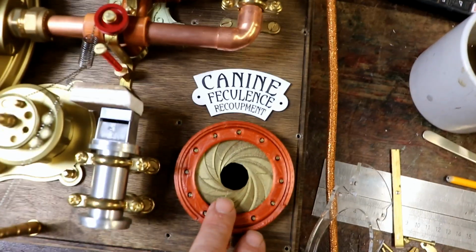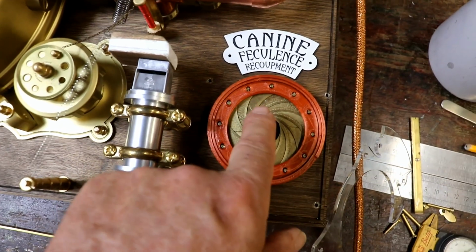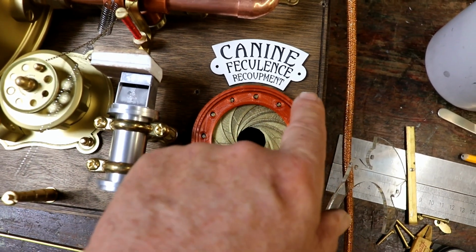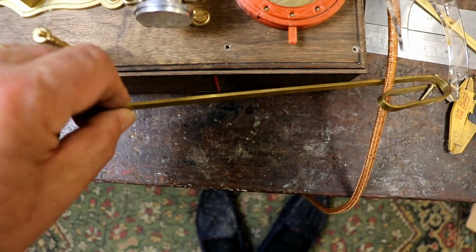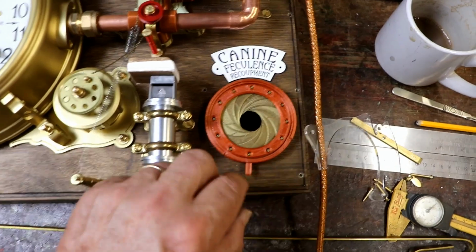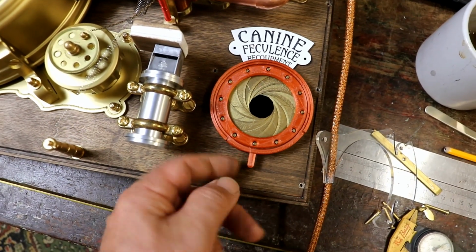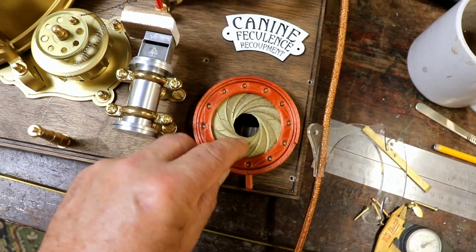So my latest thought is to make up some little brass brackets. I've got these 4 screw holes anyway that are supporting this. I can't use that one because that's where the knob goes, but I can make up 4 little brass brackets to go under the screws and sort of Z shape to just go over the edge of this, made of some nice brass strip. I'll give that a go, and the more I look at this, actually, it does look rather nice with that side at the front. It looks a bit plain. That looks interesting. Perhaps we will do that. That solves that as well, because it makes this knob easier to move because it's much nearer this side.